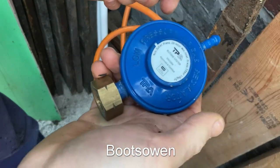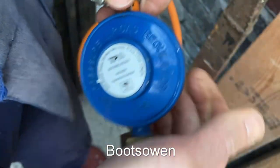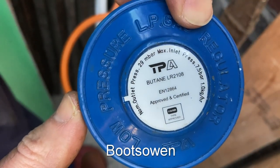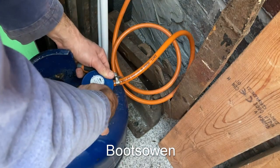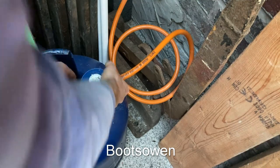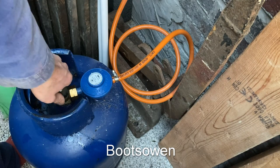On the other end of the hose I need to stick one of these regulators for the gas — I've got the hose clip on already. Push this in and tighten it down. It says butane, 29 millibars out. Then down here is a bottle of gas — there's a lid and it's got the screw thread going the wrong way, so when I'm putting this on I have to put it on as if I'm loosening it. Tighten it down and then just give it a twist — it doesn't need to be infinitely tight, you can get a spanner on it if you want. Then we can open it — now it's on and live.